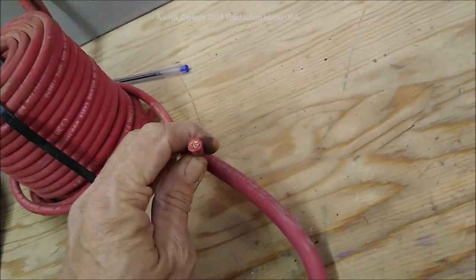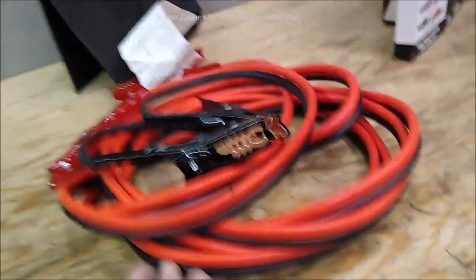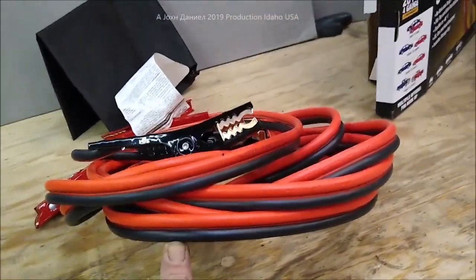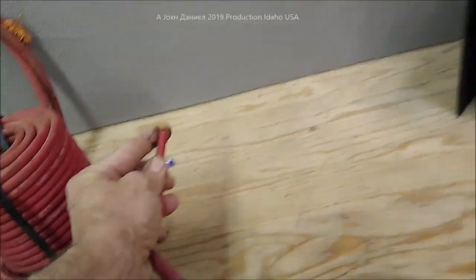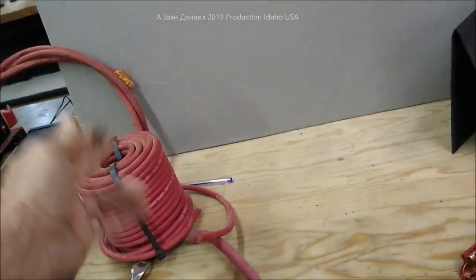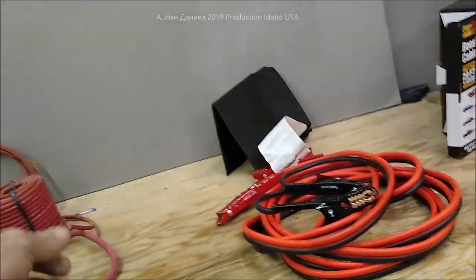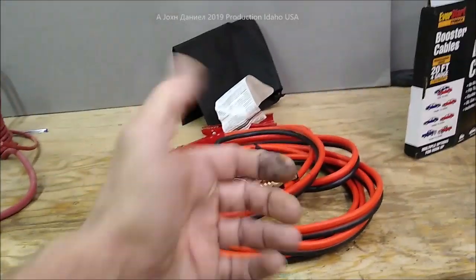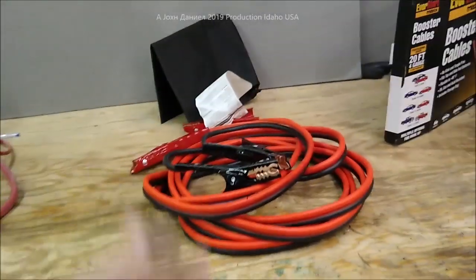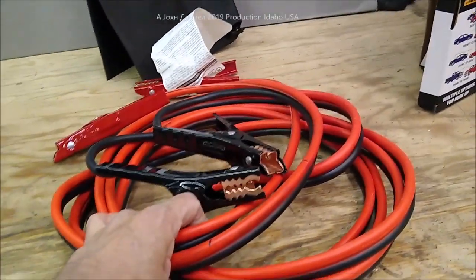Copper carries 100% of its duty rating. Aluminum is 63%. Duty rating means the maximum load it will carry for one hour. If this wire reaches 185 degrees it starts to smolder, and this plastic jacket can probably burst into flames exceeding 450 degrees. That's the reason I put the link below the video — because every big job I do I use Temco. Yes, you're going to have to give up a couple of cheeseburgers to buy the real wire, but compared to having to expel four fire extinguishers into the attic of someone's garage, it's worth it.